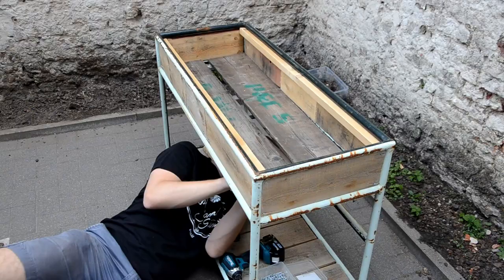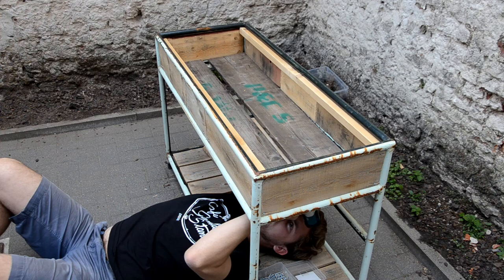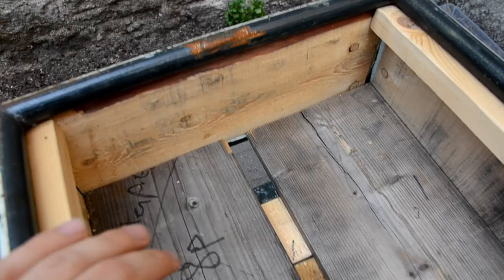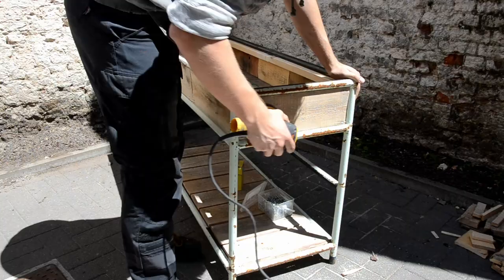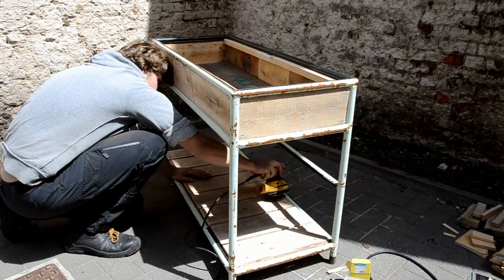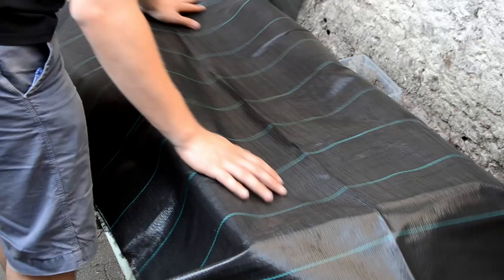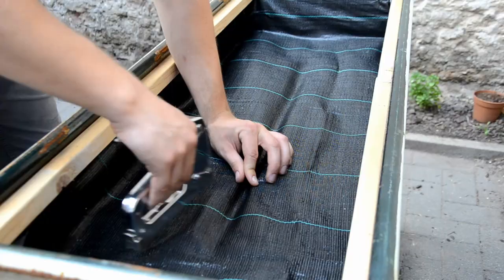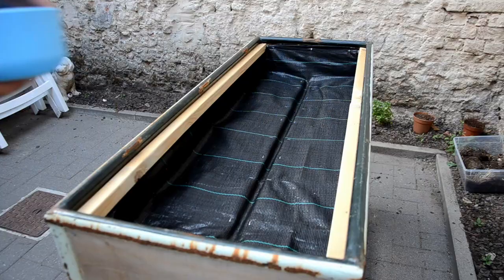It's important to note that I left a kind of trench down the middle of the box so the water can exit through a hole on the side — that way when it rains the plants won't drown. With some final sanding I'm done with the basic structure. I'm lining the inside of the box with a semi-permeable root cloth and using a stapler to keep it in place, again accentuating the drainage down the middle.